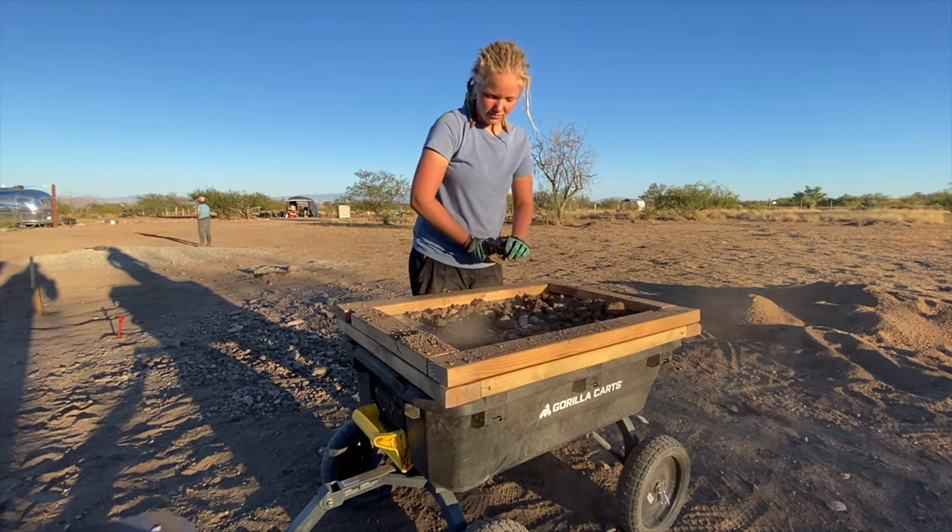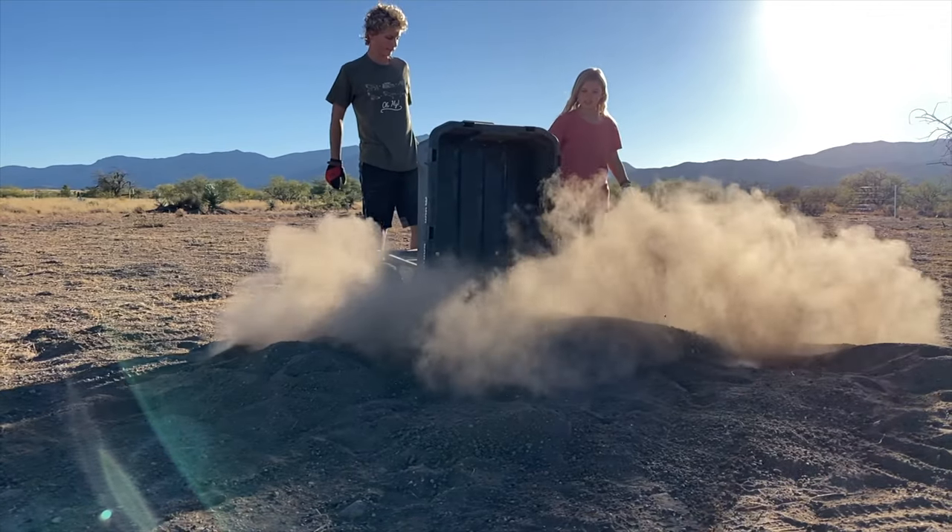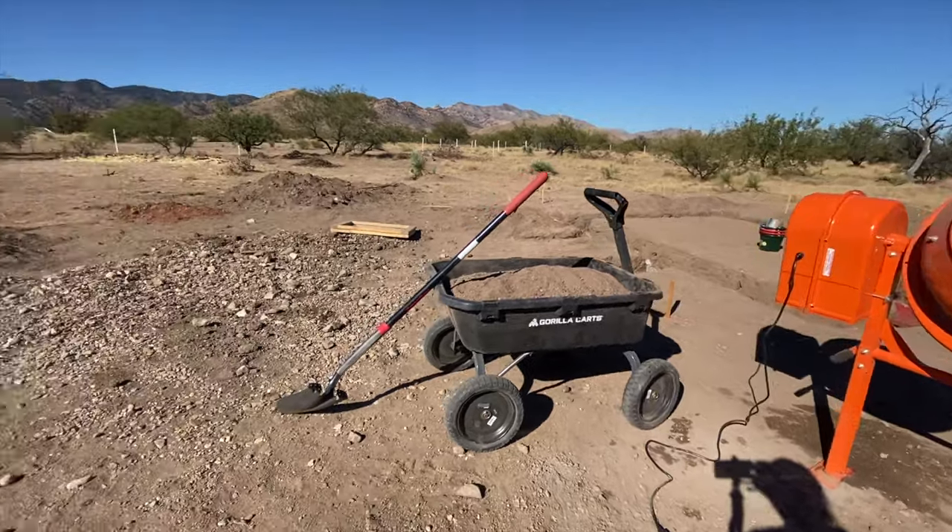Let's talk about our process, because everybody had their own job. First of all, you have to sift the dirt before you put it in the bag — that gets out all the big rocks. I made a sifter that will sit on our gorilla cart; it's just a quarter-inch screen sandwiched between some 2x4s. The kids can come out and do that during the week so we have a big pile of sifted dirt ready to go. Having two carts has been a time saver — we have a gorilla cart that's about 7 cubic feet and also a wheelbarrow. We put the sifted dirt into the gorilla cart so when you sift it, it's already in the cart, then you just bring it over to the cement mixer.